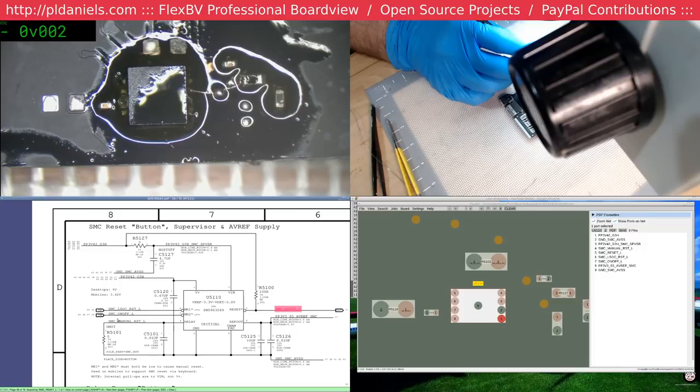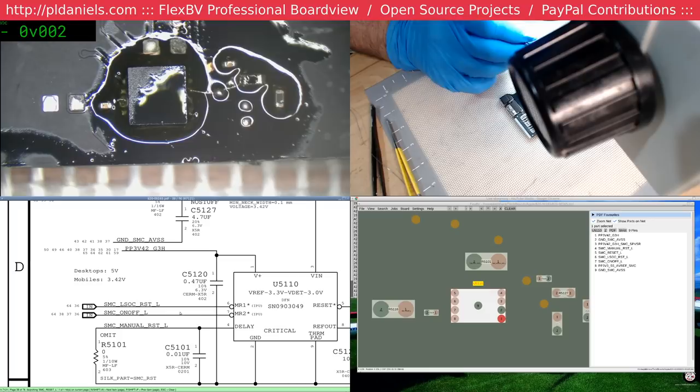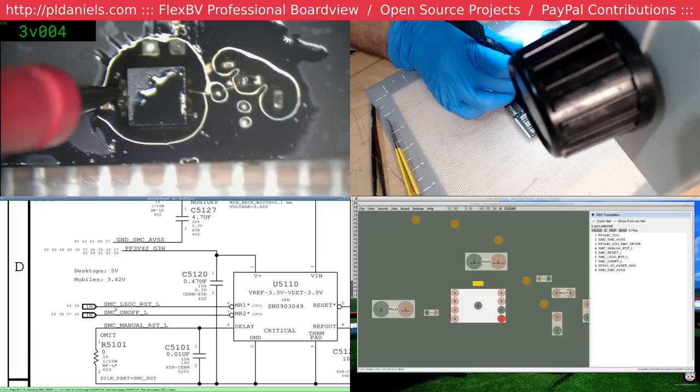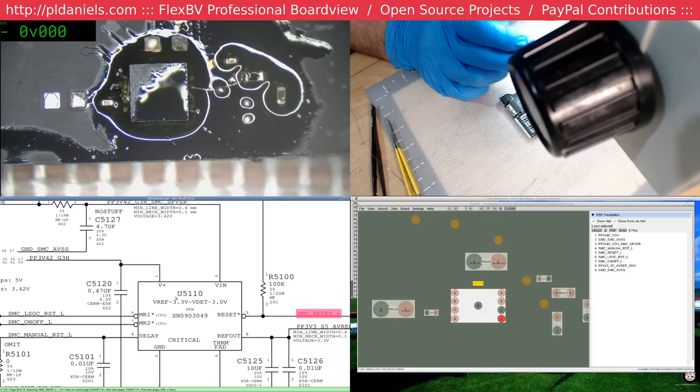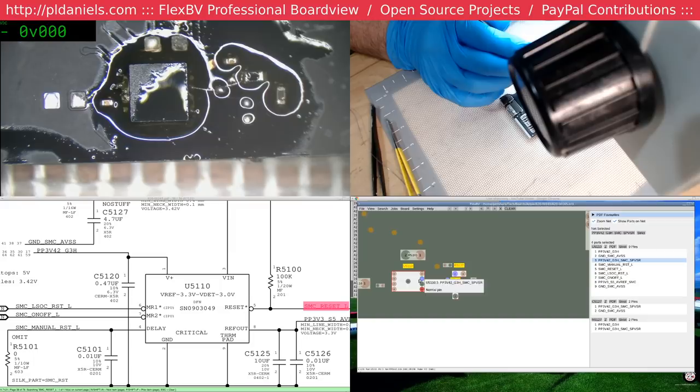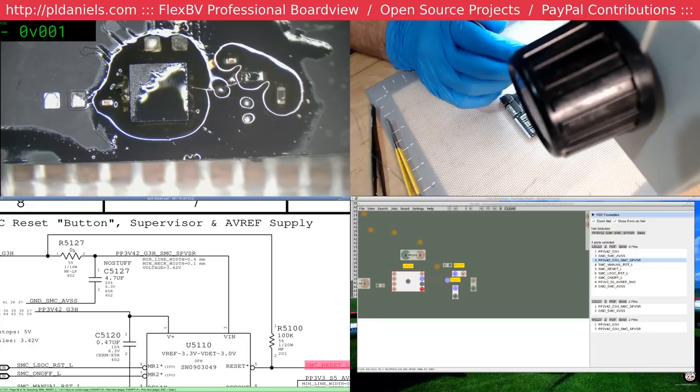They have here SMC on off L. So what does it actually mean? Does it mean it's on or off? Anyway, pin 6, reset L. That's present. Voltage is a little lower, but I don't think that should really be playing into it. Yep, that's there. Alright, so at this point, what is this pin? Pin 3? Pin 3 is V in. 5127. Wait.